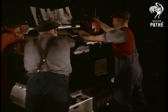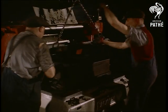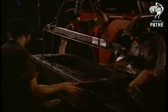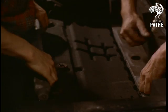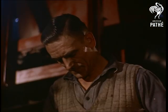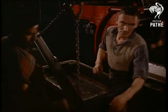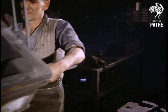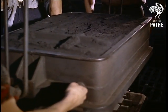The top half is made exactly similar to the way in which the bottom half was produced — first the moulding box, then the sand, the jolting machine and finally the ram. Before the final cores are placed in position, vents are checked to allow gas to escape when the molten metal is being poured in. The two halves of the mould are placed together, accurately located with large dowel pins. After being securely clamped, the completed mould is ready to be filled with molten metal.